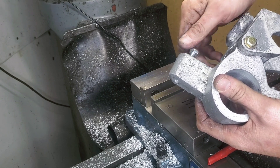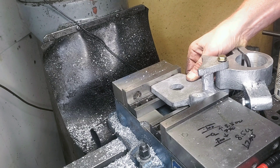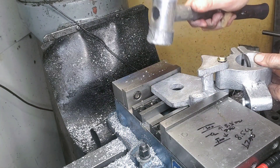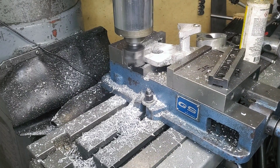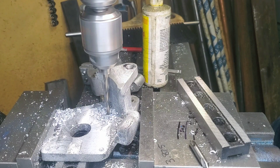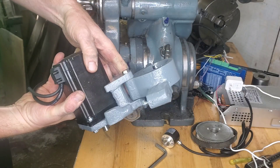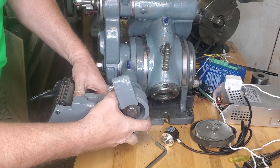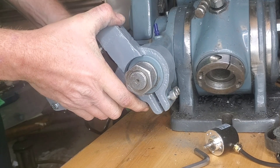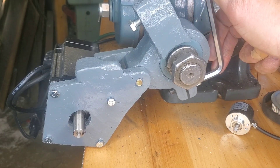Let's throw everything together and have a look to see how that worked out. Let's put this correction screw — that we cut the radius on the top of — in and make sure it's actually going to fit. It's just a matter of bolting this down and grabbing our lead hammer and tapping everything down to make sure these parallels are parallel with the work. There's also a video on how I modified this dead blow hammer to have lead on the end of it — you might want to check that one out. After machining that with a 2-inch face mill, it was pretty simple to come through and drill these holes to size. Let's take this out, clean it up, throw some paint on it, fit it up and see what it looks like. I'm pretty darn happy with how this turned out. Is there something I could have done better, or any questions? Just throw them in the comments — it's always important for a shop guy to take constructive criticism, because it's only going to make us better and drive us to make cooler and cooler inventions.